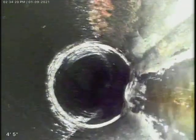We're just about to come out. Now we're going to go towards the street clean-out and zero out the counter. Put the kitchen sink on — we have a nice good flow, slight amount of buildup. That's something that just has to be cleaned. You can see the scum layer just on top.